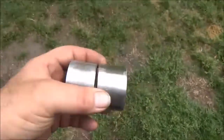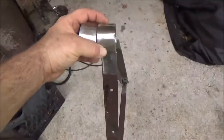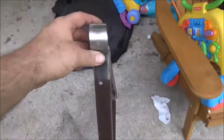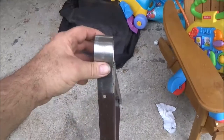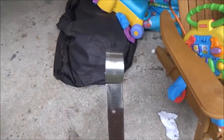I've got two pieces. What I'm going to do is set them right there and weld them in place like that. But they have to be straight, because if they're not, the pipe will rub on one side or the other and just wear out.